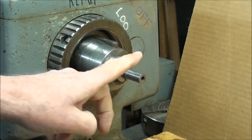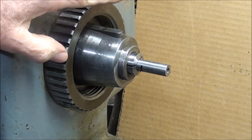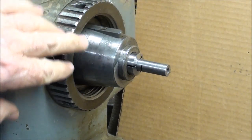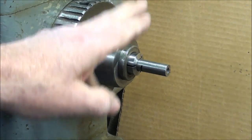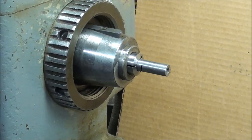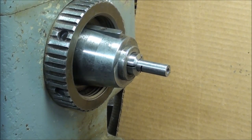With a short piece of half-inch stock held in that collet, I'm going to put the lathe in back gears and snug down the collet real well with an adjustable wrench. Any lathe with a regular threaded spindle has a thread protector so you don't damage the spindle or threads. I do not have one for this lathe, and if you ruin the spindle or damage something here you have really ruined the lathe — maybe not repairable. So I cannot use it without either a spindle protector, or a dog plate, or something. Furthermore, this is going to spin when you turn the lathe on. So I'm going to use the drive plate, or dog plate, as the protector. In a later video I may make a spindle protector; I've looked on eBay and been unable to find one. But for now I am going to put the dog plate on to protect everything.